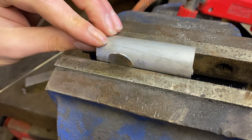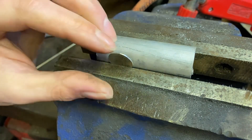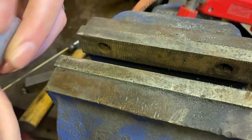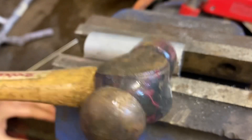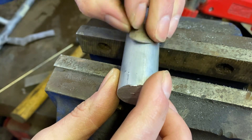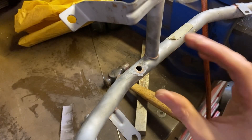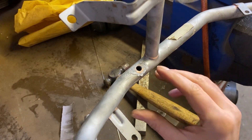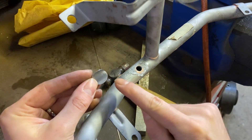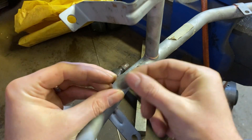I've found a nice little bit of aluminium that's about the right size, got it clamped in the vice - it's not going to take much effort to get this round with a small hammer. We'll beat that round and try to get a nice uniform profile. We'll offer it up and see if it fits, and if it does we'll flux it and get ready to solder. I've only put flux on this bit - a little bit more than I would otherwise - because I don't want silver solder flowing into the hole; I just want it to fill around the hole.